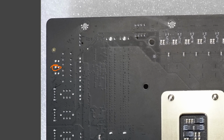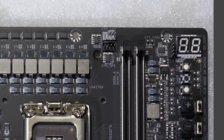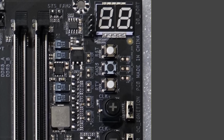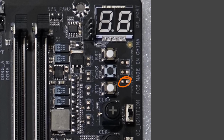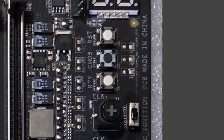What you have on the back or front of the motherboard is, well, that's not what the CPU is getting, so that doesn't really matter that much, but you can measure that too. So you have all of the core voltage measuring points that you could ever want, and more than that even, because I have no idea why you'd want the Super I/O reading, but it's there. I guess you can check if the Super I/O is connected to die sense or socket sense with this read point. I don't know why you'd want to do that, but you have the option.